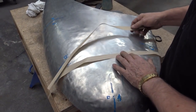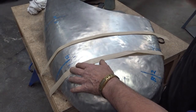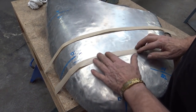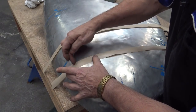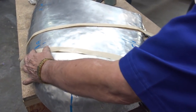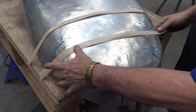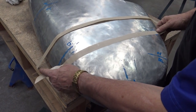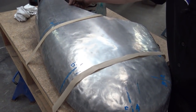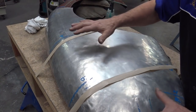Also, it'll be handy to have some strips of paper. Don't use tape, because tape can stretch when you take it off. Once the grid is drawn on this mudguard, you can then eyeline and mark all your lines on the paper and check it out in this fashion. You're obviously not going to put it like that if the grid is different. You've got to put it exactly the same where the grid is and you mark all your lines. That's a second chance that you get to make sure that you're right. So you use paper over the grid, and you finish off. You have a line here, obviously, off the old grid, and you mark it all in, and you make sure that everything is the same.